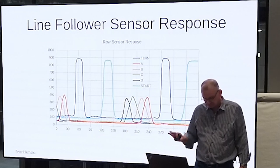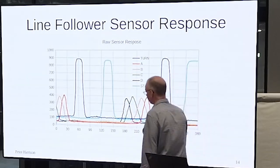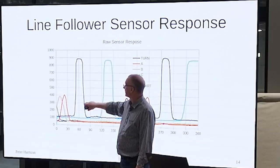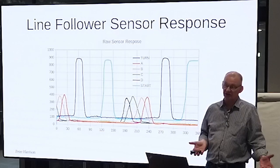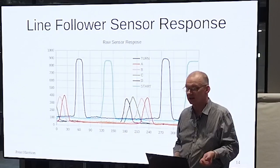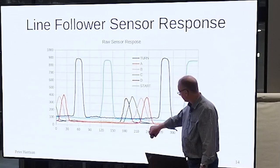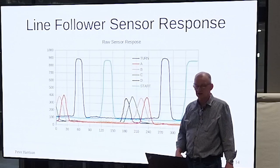What you have here is the result of reading the sensors as you get the robot to spin on the spot over the line. It starts off parallel to the line, spins through 360 degrees, and this is the record from the sensors. So you can see these are the marker sensors. The response for the marker sensors is very different in two obvious ways. One is it's much larger, and another is that it's much flatter. That's by design for the version I built, because the marker sensors are really effectively binary outputs. I want them to just switch quickly when they detect a line. Whereas the line sensors have this triangular shape, close to Duncan's perfectly good model of a cosine. I would only say that on this one, I adjusted stuff so that they gave a pretty triangular pattern, which has its own benefits.